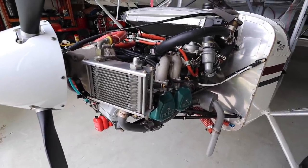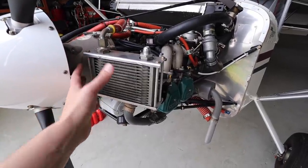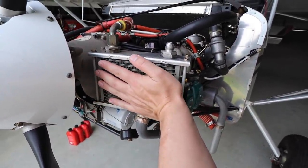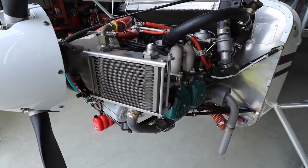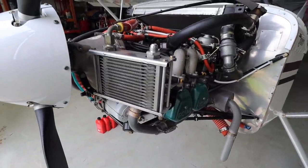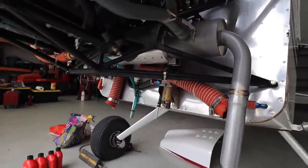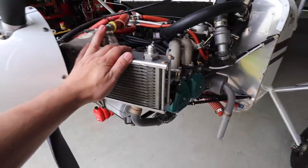During an extended climb the oil temps were just climbing way higher than we liked. Right here, this is the stock oil cooler. It fits into what I'll call the nostril vent by the spinner, and compared to the size of my hand, it's not the biggest cooler in the world. In a cooler climate or if you get it set up perfectly you could probably keep your temps down, but we're having trouble. So we are adding a secondary cooler which we're going to mount down underneath the bottom where exit air from the cowling will get a little bit of flow through it.